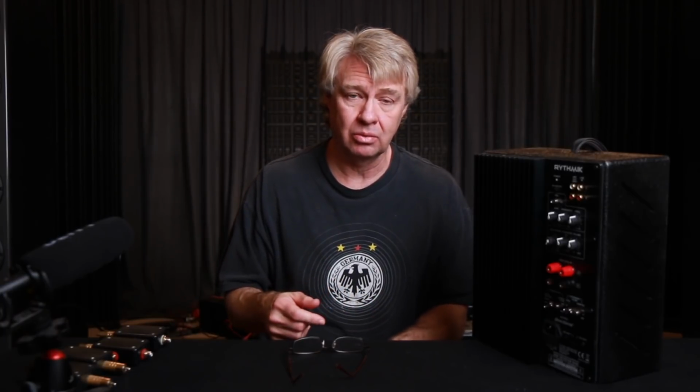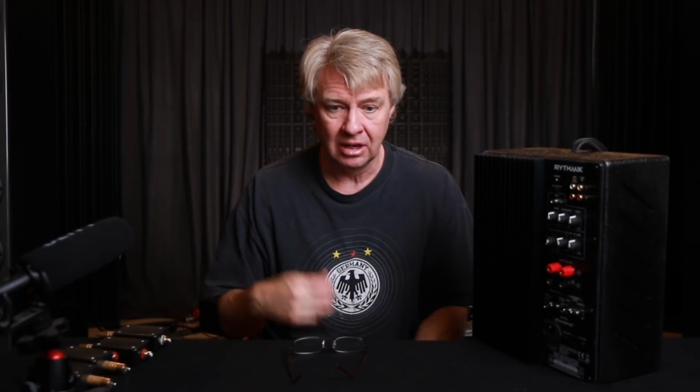We've even been at shows where we've had big open baffle servo subs up front, and we've got sealed box servo subs in the rear corners of the room, and they're set at 25 hertz and down. So they're playing part of the bottom octave back there, and we can adjust the damping settings on just the rear subwoofers and change the way the whole system is imaging. It's kind of eerie, but it really does do that.